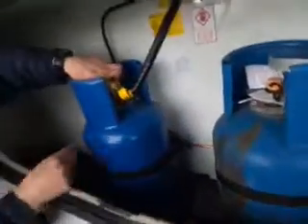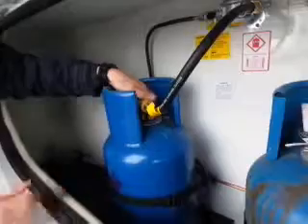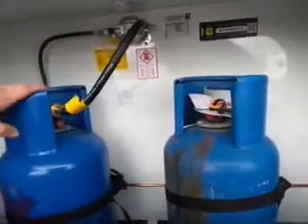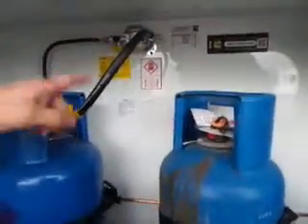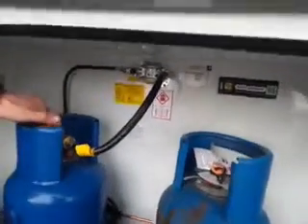So that's switched off. So it just should do it. And then we switch it on - that stops it from actually lifting up. The regulator there - you can use propane or butane off that particular regulator, so you can use red bottles if you want to. But you'll need a different pigtail. This one is obviously fitting for that type of bottle. The propane is a screwing type.